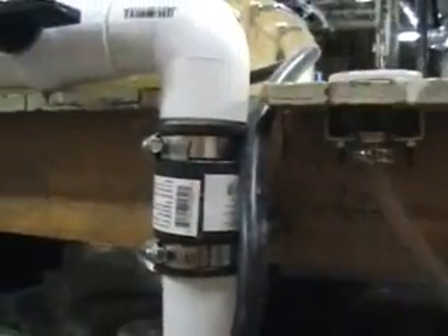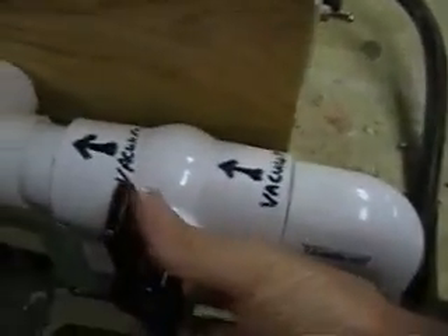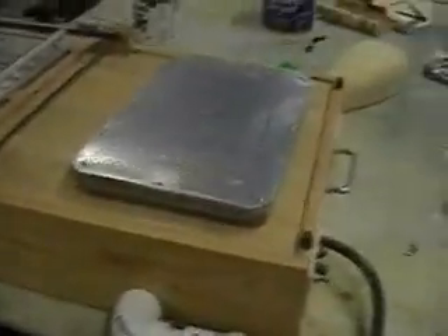I come back up and in here I have a plumbing fitting — you can see where I can pull this off. I didn't want to glue it permanently in case I need to remove this from the table to work on it. When I come up I have a valve — just a ready-to-cut-off valve. It's kind of tight but it works well. Once you lock it up and turn the vacuum on, it'll really pull the vacuum, and when I pull the ABS over, all I do is turn the switch and my vacuum pulls.